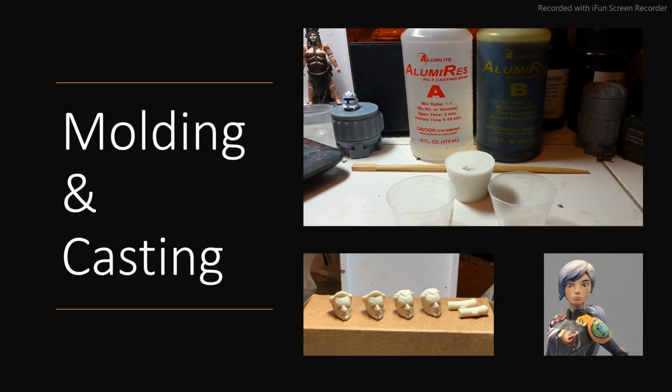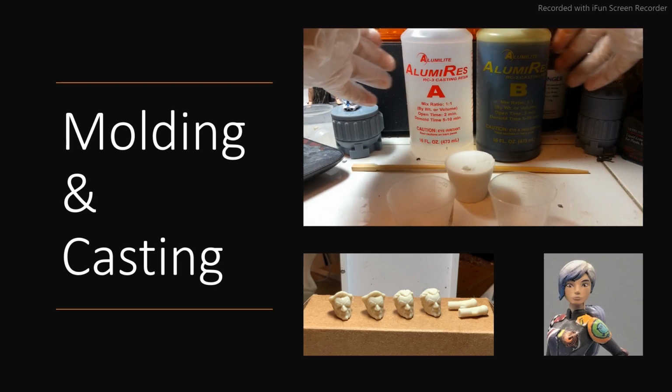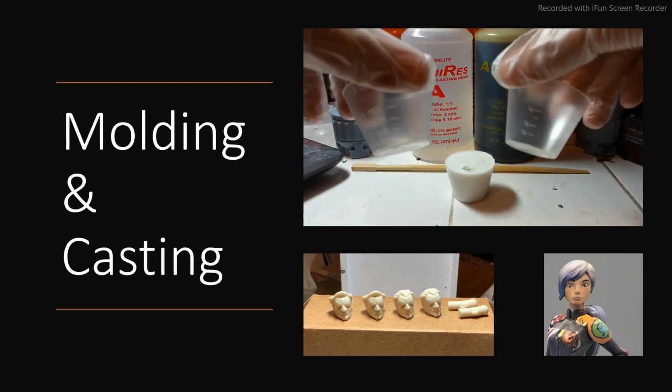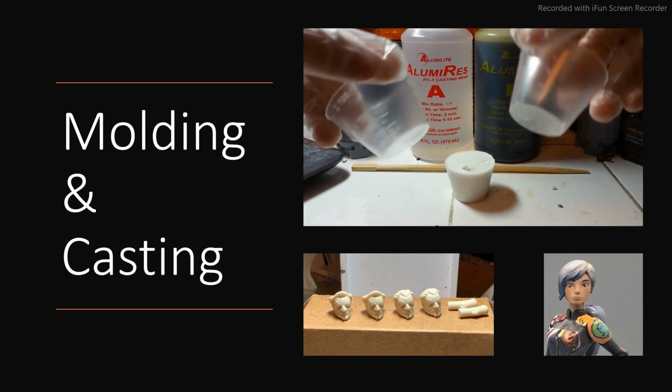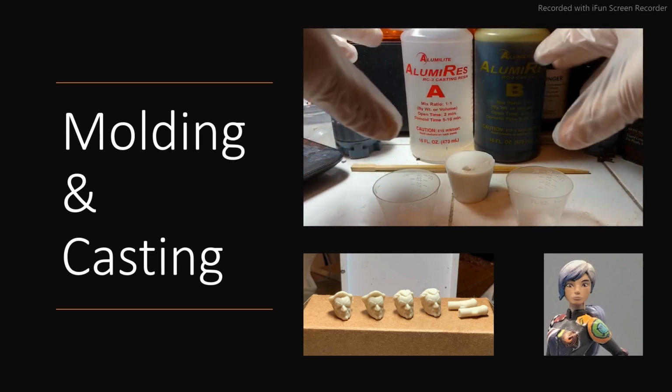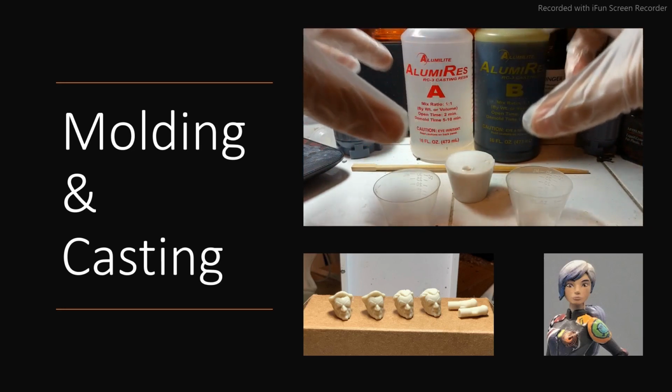So what I'm going to be using to cast this is Alumilite resin, and this stuff is a 1-to-1 ratio by measurement, not by weight like the other one. You just measure the milliliters, and it cures in 7 minutes. So you kind of have to work quick.